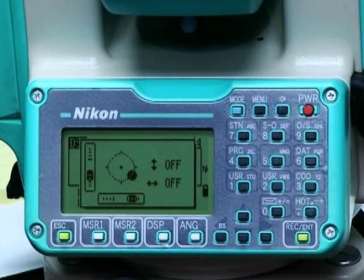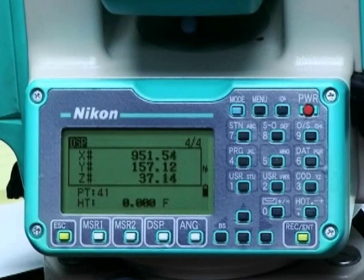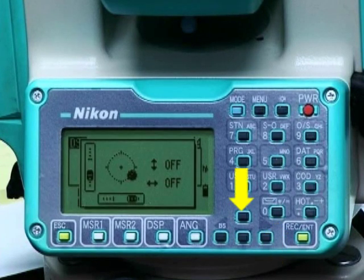To turn the compensators on, use the following steps: 1. With the instrument turned on. 2. Press the level vial key, zero numeral. 3. Press the up or down arrows until the words 'off' are replaced by out-of-level values in both directions.